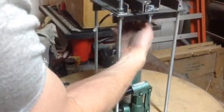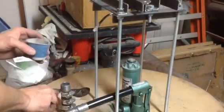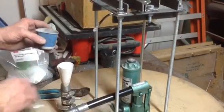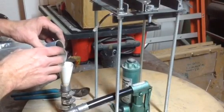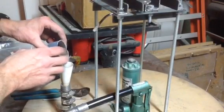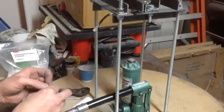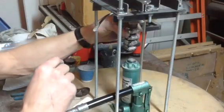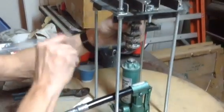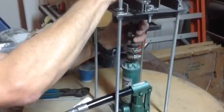The dies are brazed together using 3/8-inch nuts and washers. I say brazing, not soldering - brazing. The important thing is that die is slightly undersized, and that's why I use the cotton wad over it - not unlike using a paper or cloth patch with a muzzleloading ball in a muzzleloader. That forms a nice tight fit and also keeps the dust from coming back out since I'm compacting dry propellant.